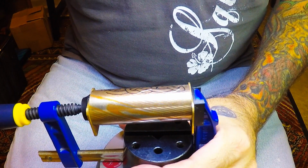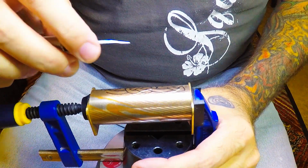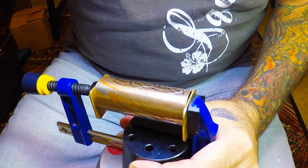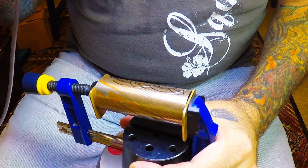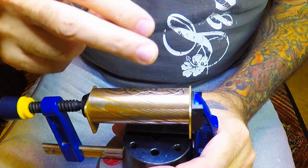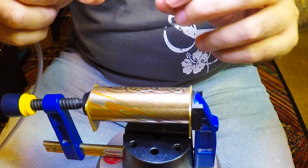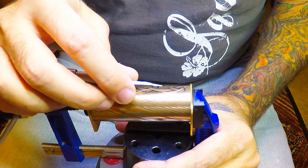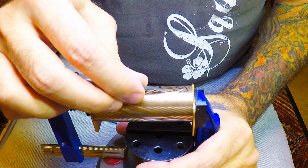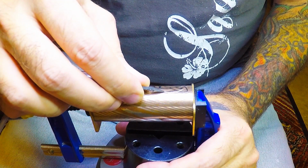With my graver nicely sharpened and polished and set correctly, I'm going to start the process of the engraving in earnest. Now, as an engraver at this point, I have a decision. I can either cut outside these lines or cut to the inside of them. And as I said, in terms of the lines that are actually drawn, it looks like they're stippled. So I'm going to be going to the inside of these lines to achieve the effect that I want to achieve.